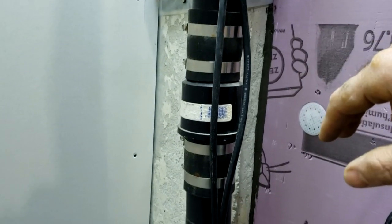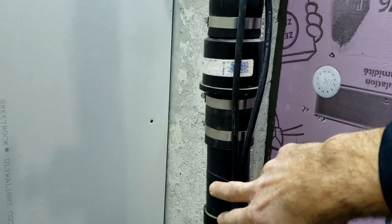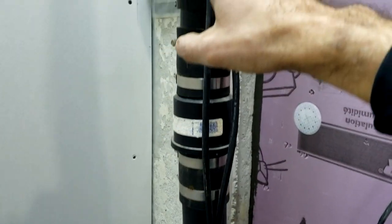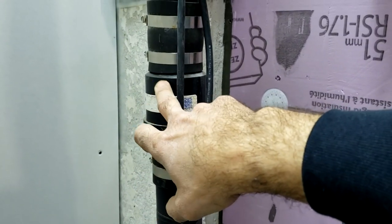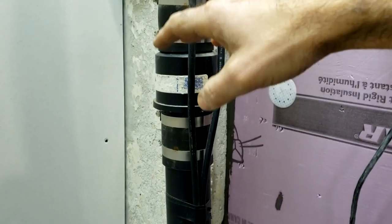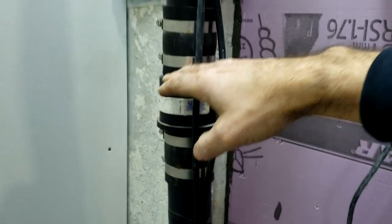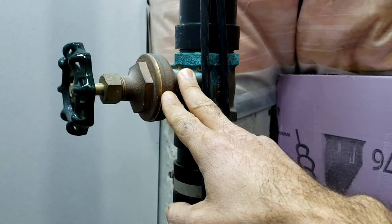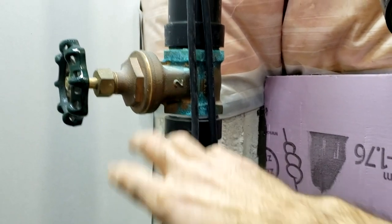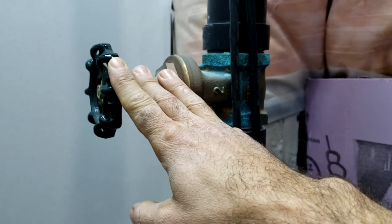The other thing required on a sewage ejector — as opposed to a sump pump — is a check valve and a union type connection. The order of flow is: union type connection, check valve, and isolation valve. With a sump pit, all that's required is a union type connection and a check valve. The check valve prevents any flow from backing up into the pit and prematurely filling it once the pump stops. The added isolation valve on the sewage ejector allows you to control any nasty stuff in that pipe — before servicing, you make sure that isolation valve is turned off, otherwise you'll be in for a surprise when you remove that check valve.